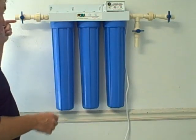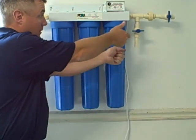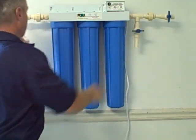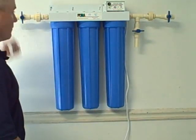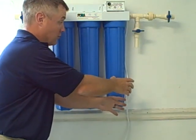After 20 seconds, with the water still on, open up your bleed port again with your bucket underneath and bleed off whatever sanitizer is left in there. Shut that valve off and close off your influent valve. You can open it up again once you've closed off your influent to relieve the pressure once again.